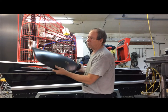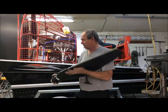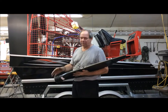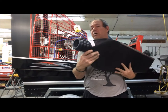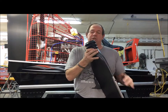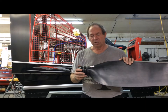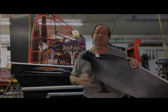It has to be okayed by the manufacturer, which in this case is Sensenich — we're dealers for Sensenich and we've been using their blades for a long time. They've improved to the R-series blades, which have a curved leading edge that works better for lowering sound. This is what the inside of a propeller hub looks like — when you tighten it up, it compresses over a longer distance than if it were straight, holding the blade in a solid position. I've never had one go out of range at 65 foot-pounds of torque.